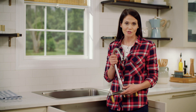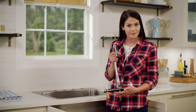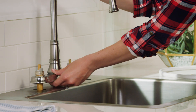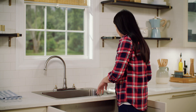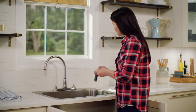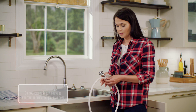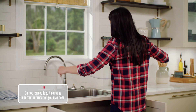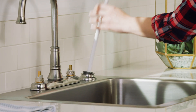The first step is installing the faucet and the veggie sprayer. We have a four-hole sink configuration — three of the holes are for the faucet and the fourth hole is for the veggie sprayer. We'll start by setting the faucet, and you can move the spout to balance it. Next, we'll take our support assembly and our trim ring, seat that in there, put it down through our mounting hole, then take our veggie sprayer, wrap the tag to make it easier to put down into the hole, and simply feed it down.